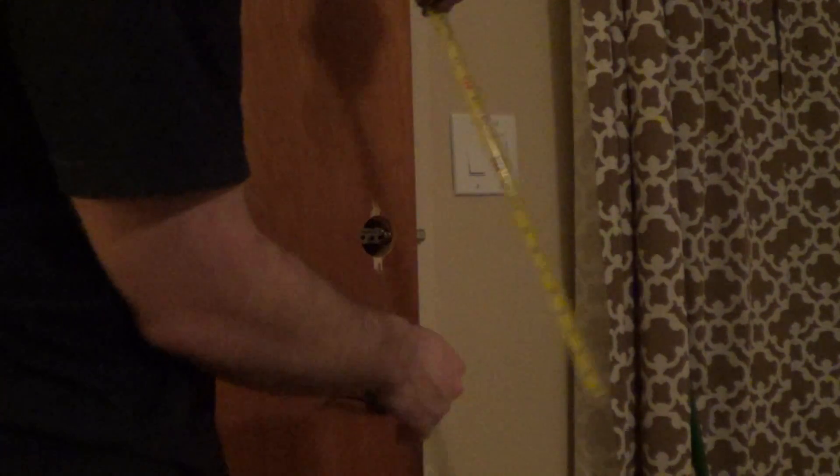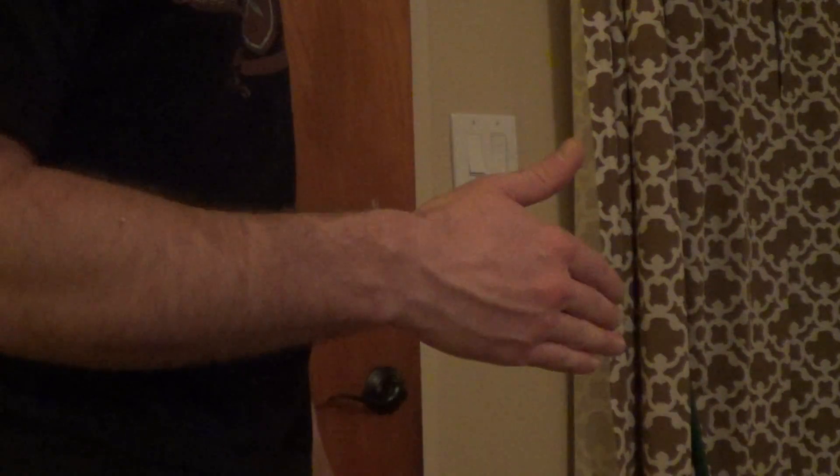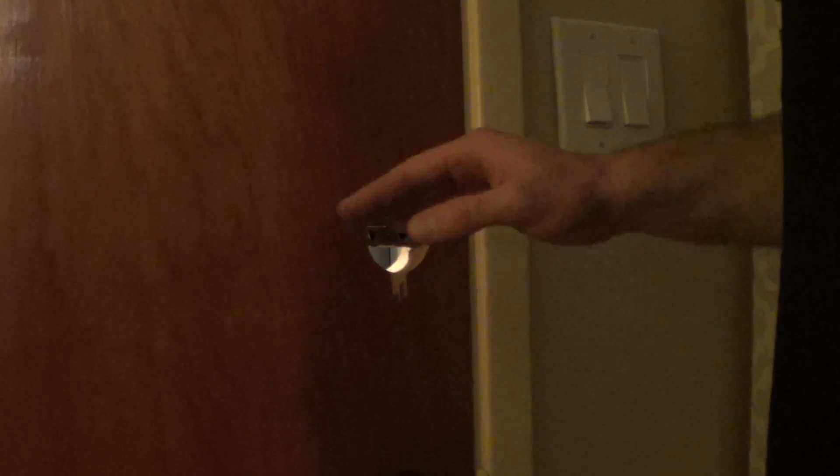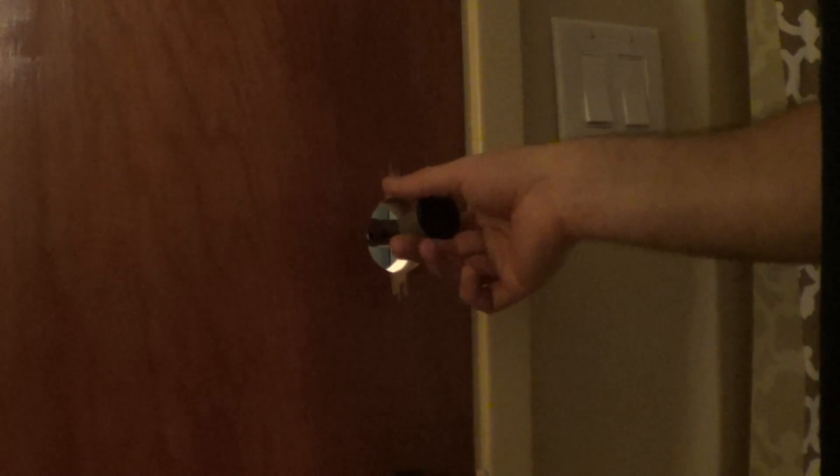What we're going to do next is drill into the other wall so the deadbolt can go all the way in. I'm going to measure about eight and a quarter on the inside of the wall, mark it, and drill about an inch into the wall so the deadbolt can fully extend. I went ahead and drilled into the door frame. This is a pretty important part because you want to make sure the bolt moves back and forth fluently — make sure it doesn't stick anywhere. One way you can do that is use the key, stick it in the bolt kind of like a puzzle, and turn it back and forth. This will tell you if it's sticking anywhere. These locks are battery powered, so if it sticks it's going to kill your battery — this is a pretty important step.